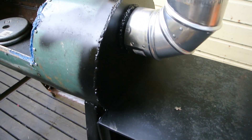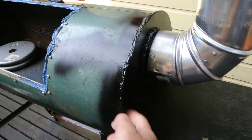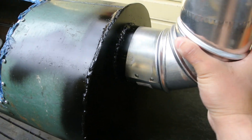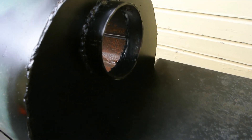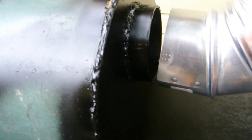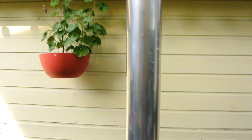I'm getting it all put together — hopefully you can hear this because it's a little windy. I got a smokestack put on the smoker now. I welded in a plate and on it I welded a flange that I made myself, just bending some steel all the way around, then welded it all the way around and painted it just to keep it from rusting. I'm going to put a couple feet of four-inch pipe for the smokestack.